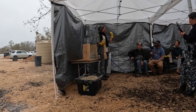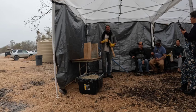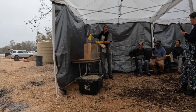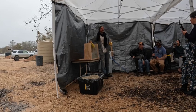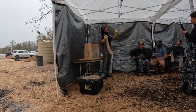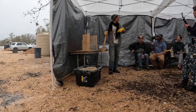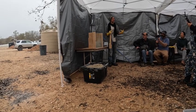What will tend to happen is you'll get distracted. Someone will say, hey, can you pass me that, or can you come and do this, and you come back. Even worse, and more often, someone else comes into your area and throws some hemp in there when you haven't finished tamping. All of a sudden you've got another 3-4 inches of hemp in the space, and they're not aware that you didn't finish. So you really need to own your spot. Don't just say, oh, it's more fun over there, or it's lunchtime, or even if your phone goes off. Really own what you're doing.